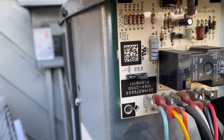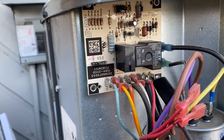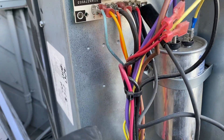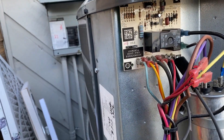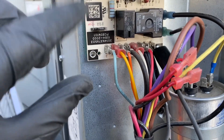You can change the timer — on the Goodman it can be 30, 60, or 90 minutes; some go up to 120. That way it's not constantly going into defrost. My defrost thermostat was already tripped since it's about 37 degrees out here, so without the timer it would be going into defrost all the time.